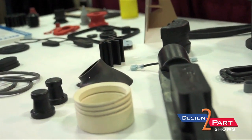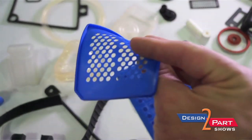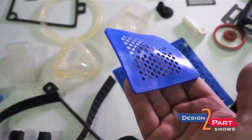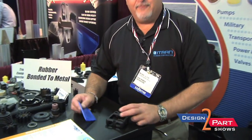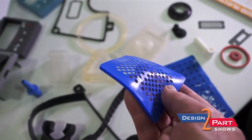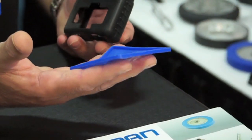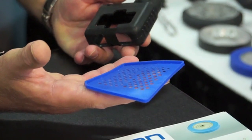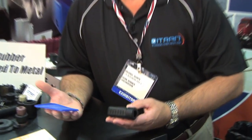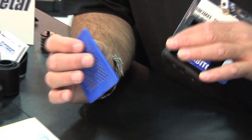We've been working with liquid injection molding for almost 30 years now — since 1982. A couple of the pieces that we do in the liquid really lend themselves to high precision molding. You can mold parts like this that come out of the mold flash free. There's very low pressure to injection mold it. It's a platinum cure system, and most of the liquid materials today are class 6 medical grade.